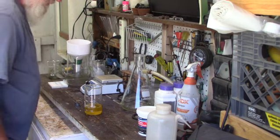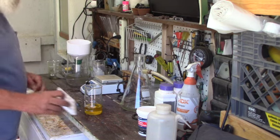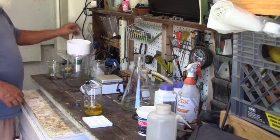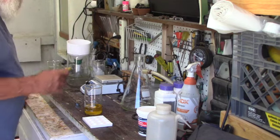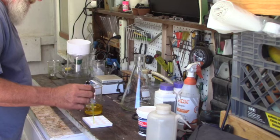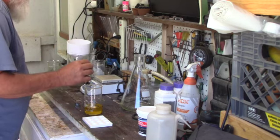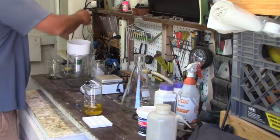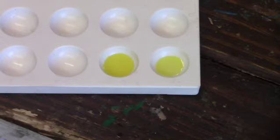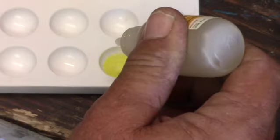If you have excess nitric in a solution and you put it in your spot plate and do a check on it, it will usually come out positive, although it is a false result. If you try precipitating with SMB and your solution starts getting brown and then goes back to yellow, you have too much nitric in there still.